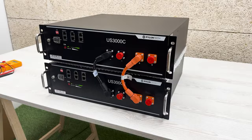Step 6. The balancing procedure will end when all the connected battery modules are balanced. We have to wait until the LEDs indicating the state of charge turn off completely. This indicates that the batteries have entered sleep mode depending on the charge difference between the different battery modules. At this point, we have to look at the charge status LEDs of the batteries. The run LED should continue to flash, indicating that the battery is operational but at rest.